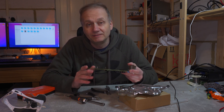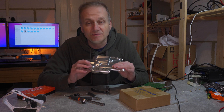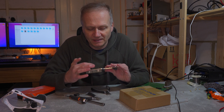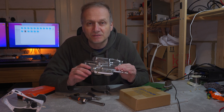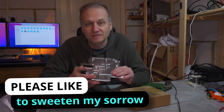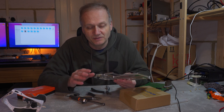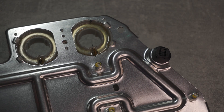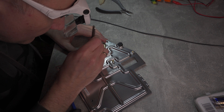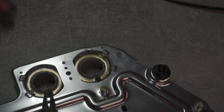I really don't know what to do, to be honest. These sensors are embedded into plastic holders and covered with some sort of resin. My plan is to try to remove them, cut them out, and maybe try to solder a pin back into the sensor. If anyone has any ideas I would be really grateful. I had a good look at the sensor and could not see any remnants of the leg remaining on the body of the sensor, but I decided to remove it anyway. I used a scalpel to dig it out and see if there's anything left on the legs where I can solder in a metal pin.